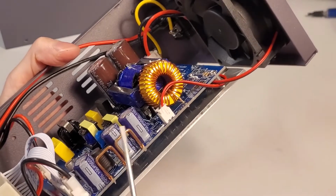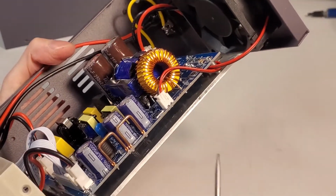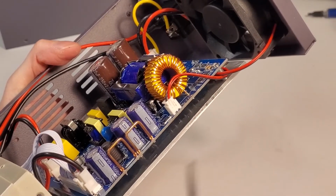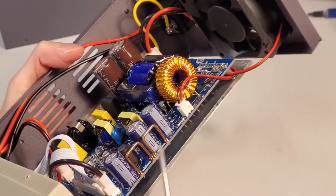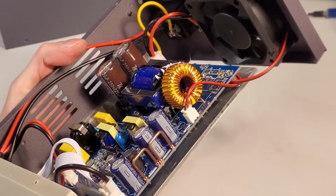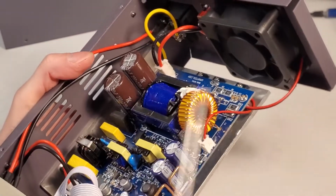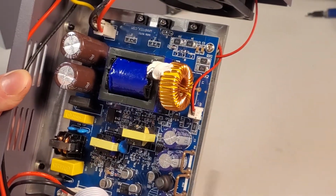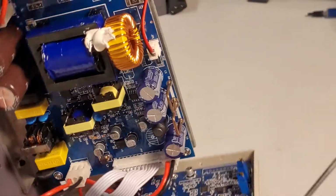These two copper things here, you'll see those in multimeters. Those are typically low ohm, high current resistors. They're basically copper, and you just rely on them to be close enough to 10 milliohms or some arbitrary value that they designed the circuitry for. Yeah, in general, very surprised.